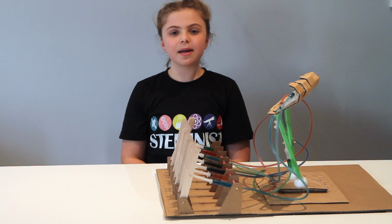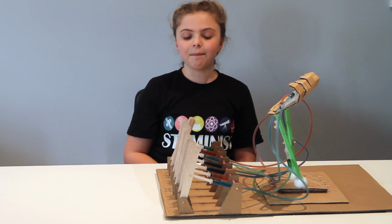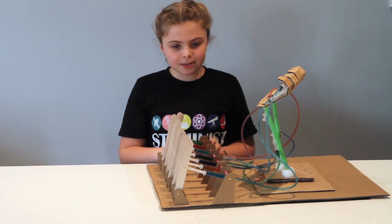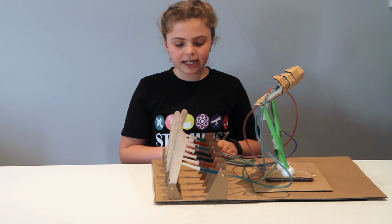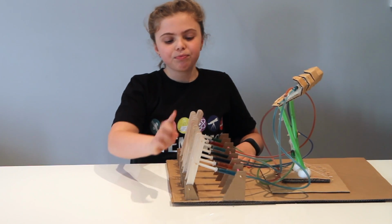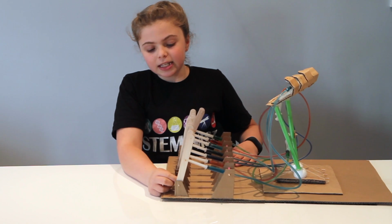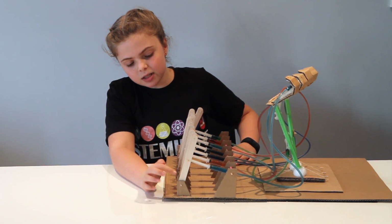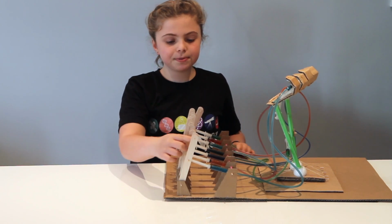I wanted to make a better and easier way to control my hydraulic arm. I decided to use levers. Levers are great because they let you use mechanical advantage to make controlling easier. Let me explain. From the end where you apply force to the pivot point is about 2 times the length from the load to the pivot point. This means I only need half the force to push it.